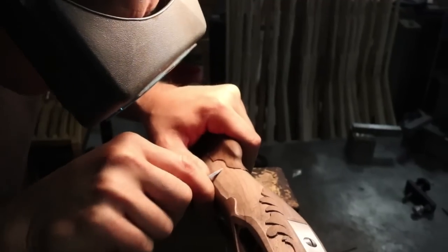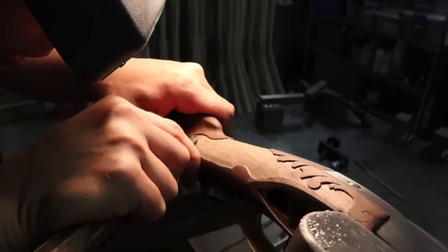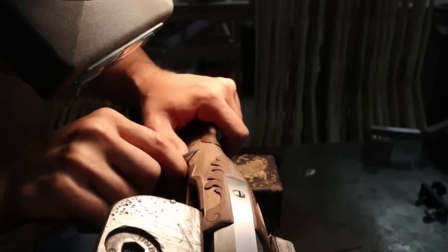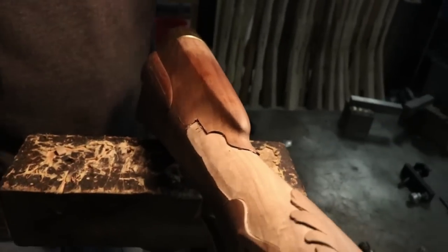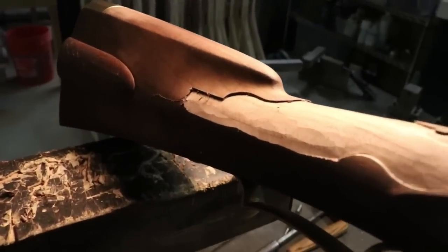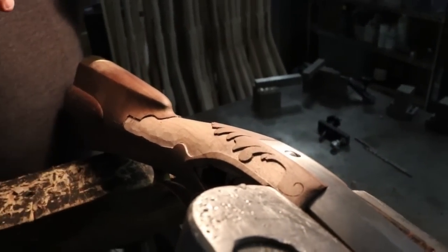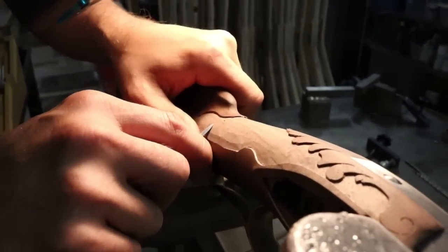I'm looking for high spots and starting to pare those down a little bit. You want cuts to be clean, you want cuts to be sliced — you don't want split wood, you don't want torn wood, and you don't want the corners of your tools to dig in. There's nothing wrong with clean cuts in a carving background; tool marks is what we refer to them as. What is bad is torn grain — instead of a sliced cut, it's a cut where the wood is broken and it shows up. It definitely shows up when the gun is finished. Just facets from a chisel are a really nice thing; there's nothing wrong with that at all.